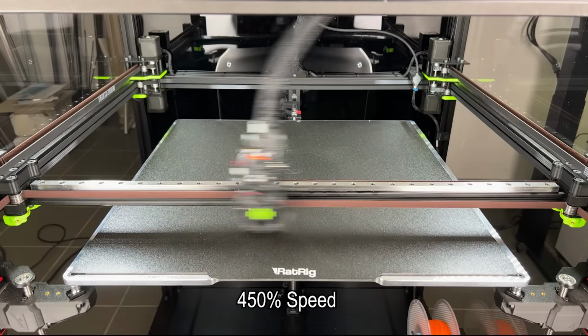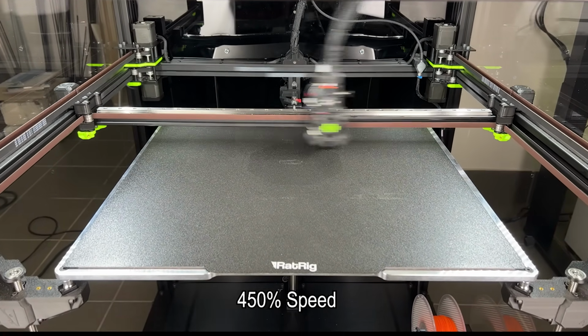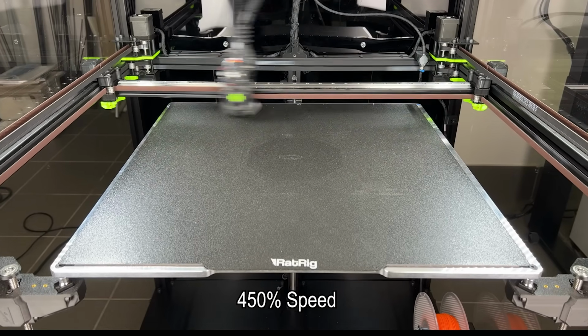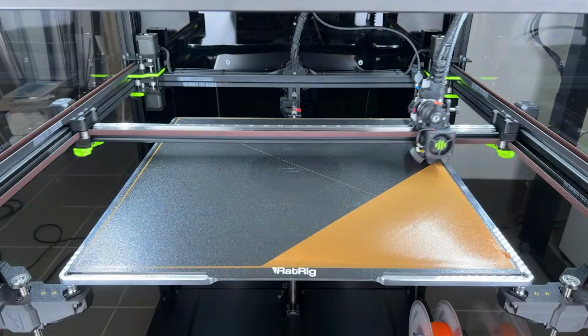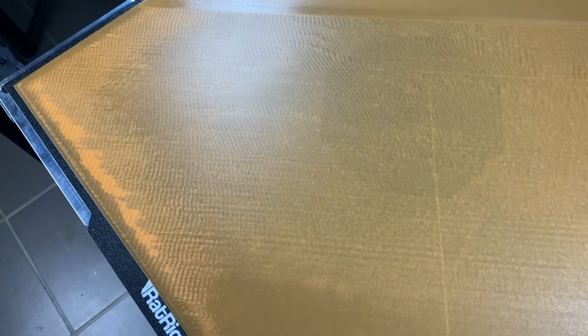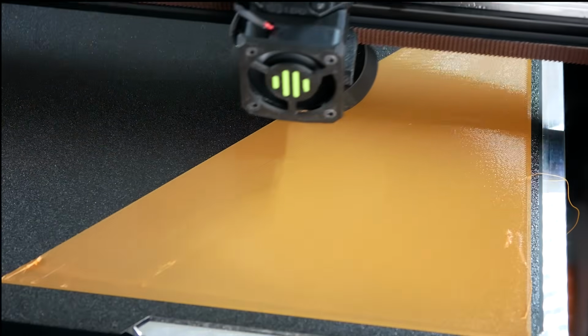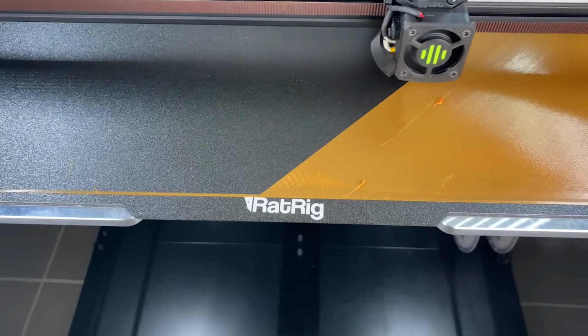Since I'll need the full 500x500 print bed for upcoming projects on my channel, I wanted to see if I could achieve a perfect first layer using the Beacon scanner. My attempt of a full 500x500 first layer failed unfortunately. The set offset between the nozzle and bed seemed to drift somehow while printing the infill from right to left. It started well at the front right corner, but gradually moved closer